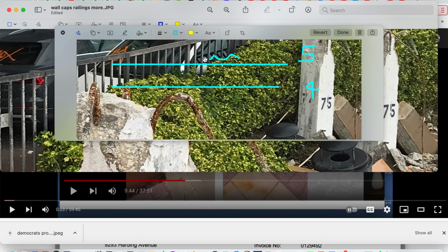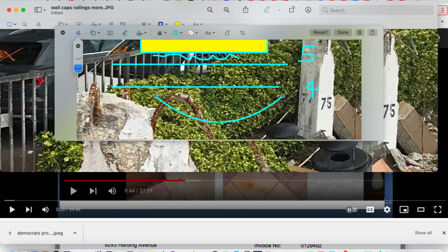The concrete that's above it is now covered by further concrete, the deck slab, the covering material, put on top by whoever came and put the slab on top. We now can't observe it. This is the covering of the number 5. So this is an inch and a quarter, or 3/4 of an inch cover, whatever it may be. It's holding the slab from deflecting in a strong back capacity. So you have to look up strong back to figure that out. Engineers, I want you to think of this as a strong back, a number 5, as opposed to a number 4 there. So it is acting like a crane, strong back, and this is the lower part that can then take deflection.